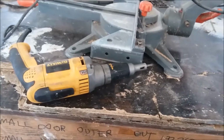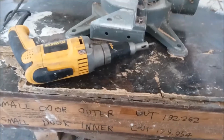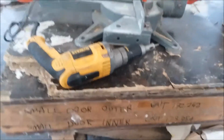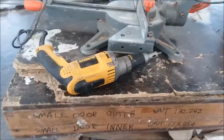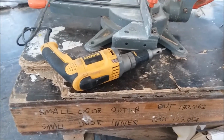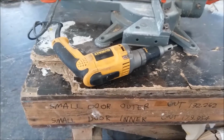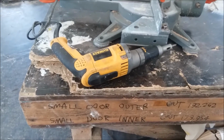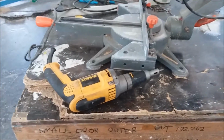And it says in the manual you pull them out with pliers. These guys can grab them with their fingers and get them out of there, but you really do need pliers. And they have adjustments on how hard to drive screws, because these are for metal buildings. Self-tapping tech screws, and you screw them through the sheet metal and then into a purlin or something like that, or C-channel, whatever you're attaching it to. Anyway, we have a couple of those, and we use these screws over and over and over again.